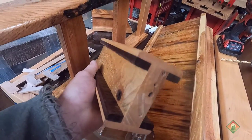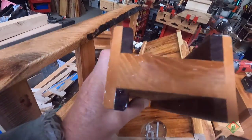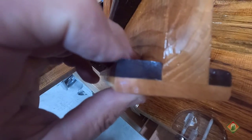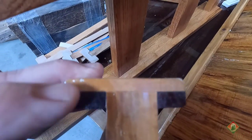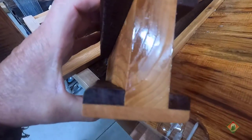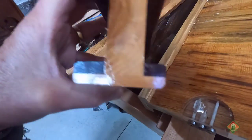That threaded tenon joinery attaches it to a post — the kind of posts I show elsewhere. That's another prototype that'll be part of the series. This next one is for people who don't have a shaper or a router. What I did here was create the dado — the groove — by doing a glue-up. You have a thin chunk of wood, probably three-eighths or quarter inch, and then I took some black walnut and using glue-ups created that profile.